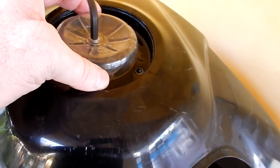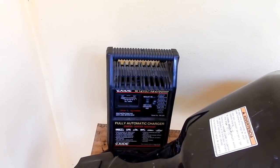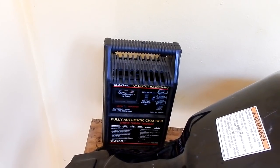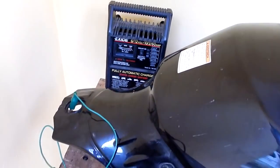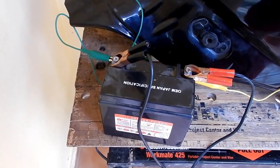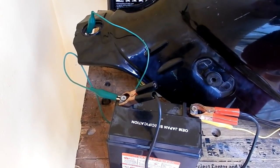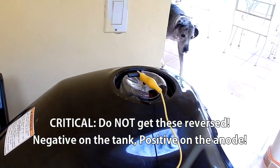In goes the anode. I had initially set this up to run directly off the battery charger, but when I hooked the battery charger's negative terminal to the tank and the positive to the anode, I couldn't get any power going through it — the automatic battery charger wasn't detecting any voltage, so it just didn't work. What I had to do was jump it: I brought a good motorcycle battery out and connected the battery charger to the battery, then connected alligator cables — negative to the tank and positive to the anode — and it works perfectly.